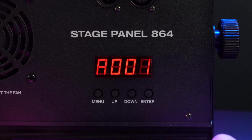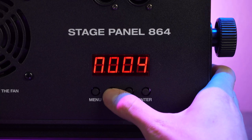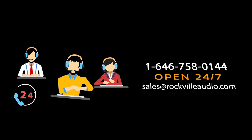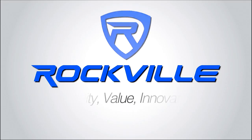Set all the master and slave lights to the same DMX address — for today we'll use A001. Once configured, if you set your master light to a sequence, all the other lights will follow. You can adjust the speed, brightness, color, and other settings on the master light and the slave lights will adjust accordingly. Hopefully this showed you how easy it is to set up your Stage Panel 864 LED Pro Stage Wash Light. If you have any questions, comments, or concerns, feel free to reach out to our customer support team by phone or email. As always, I'm Perry from Rockville — see you next time!